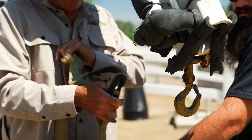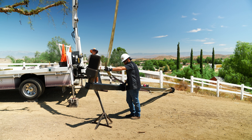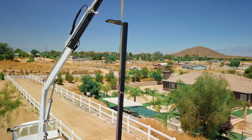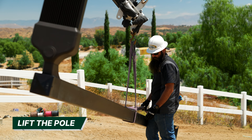If you need more length, you can connect another strap to the ends of the Y strap. You would do this if you needed to prevent a light pole from hitting the boom or load line. Using the sling method allows you to set a pole that is taller than your equipment.